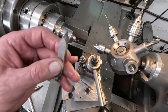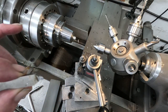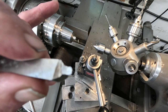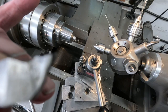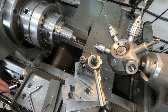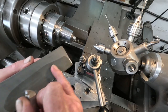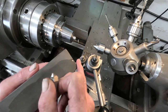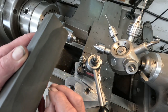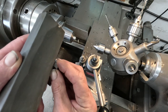Here's a classic tool — the old round nose — that cuts this way, that way, and straight in. It's quite versatile and easy to make. It's got a little bit of back rake right here, and I've got a little aluminum welded on it. It could use sharpening, so we'll do that. A little drop of spindle oil here on this stone to sharpen the top of it, and we'll get that aluminum off there. It probably got on there because I didn't put enough lube on it.